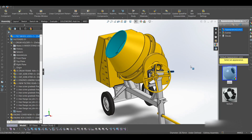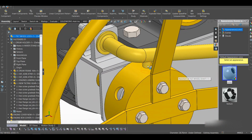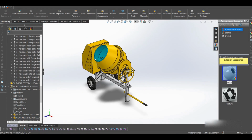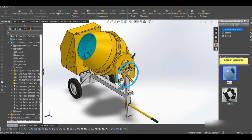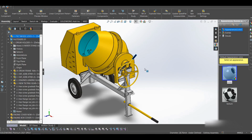Then you lock using this. You see, you lock. So this will go into the hole and lock. Then after, you can fill your concrete mixer. You fill the drum up, then you add everything, then you let it rotate. When you want to pour out the concrete, you just have to move this up, then rotate. Then you pour out, then you put back, then you lock, then you begin another phase.